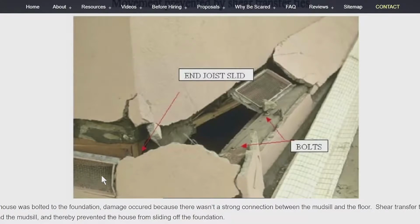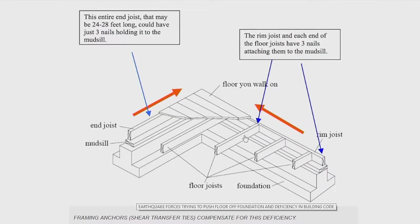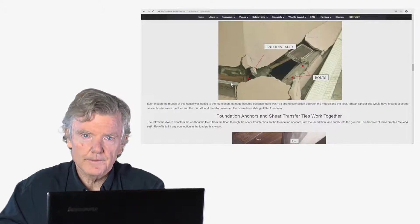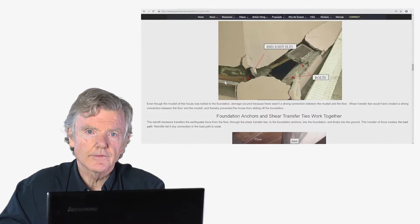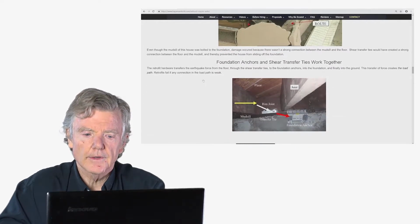that from happening. Now in the old days, before they had nail guns, there might be a joist that's 24 feet long with only three nails in it, two nails sometimes, because the carpenters were just trying to make sure the board didn't fall off while they were doing their construction. So oftentimes there's a very, very weak connection at this point. And in these types of retrofits, that's always our most serious concern. That's where we really make sure that we make a good, strong connection.